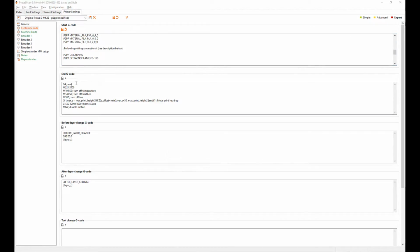So that wasn't part of the default settings I copied out of the documentation, but it is mentioned later down. So let's just stick that in there. Here you can set the number of millimeters between each ping. In this example I just used 500, so 50 centimeters. You can play around with this to see how close you need them for it to stay in proper calibration.